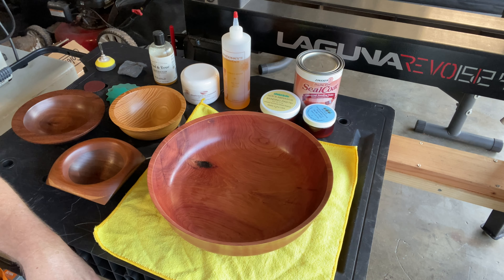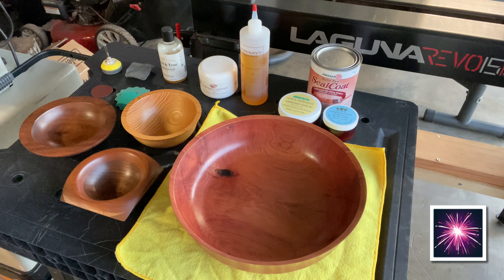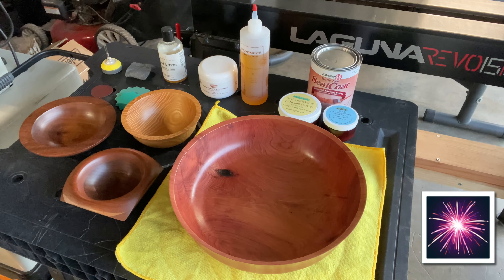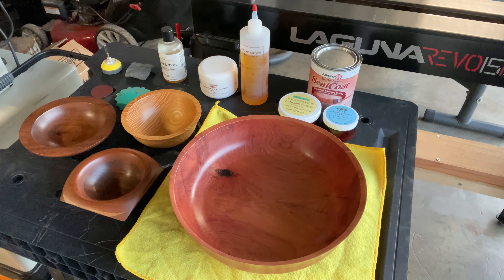It's just my preference to use food safe finishes. I've done two live edge pieces — a natural edge and a live edge walnut with the bark. I used Mahoney's on both, painted it on, and it was perfect. You can use the sanding sealer and then paint on a shellac to the bark, but painting on Mahoney's was just as great an option — even for live edge and bark.